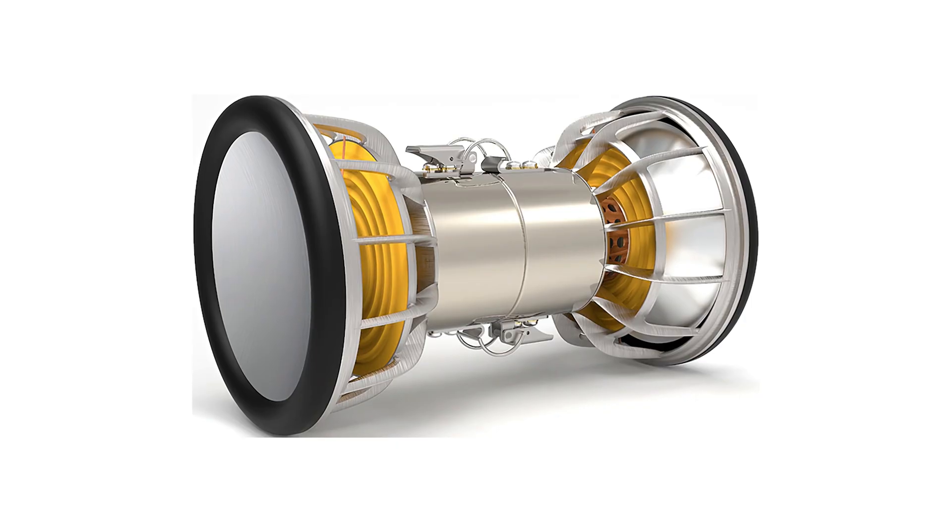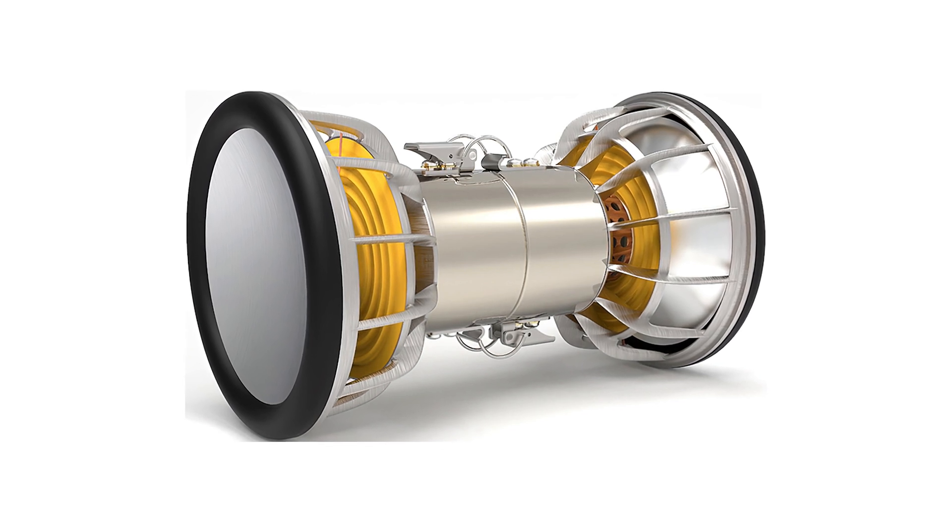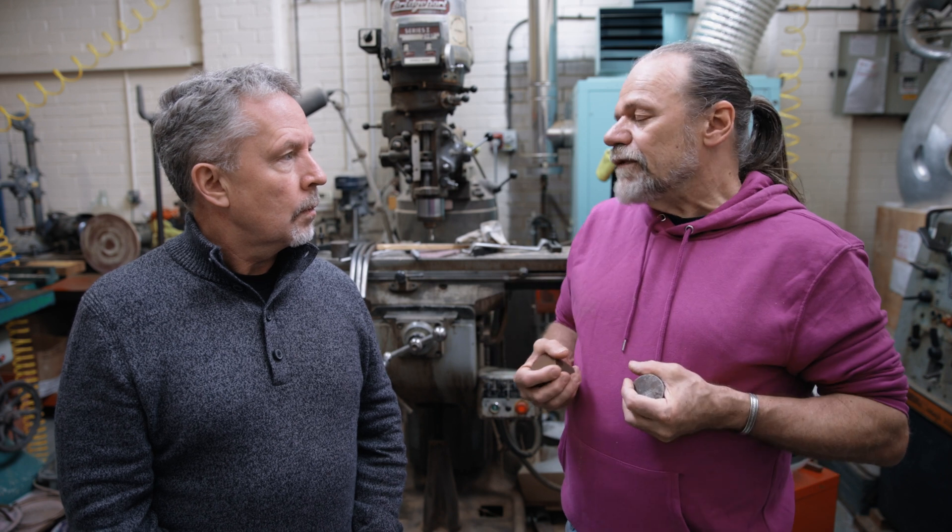There's one more thing — your drivers are actually tied together and there's a bar between them. So it's not just mounted on opposing sides of the cabinet but connected between them. Is that important? Well, yes — you need to connect the two magnet assemblies mechanically firmly to fulfil that reaction cancelling. Very informative. Thank you, Lawrence.